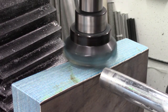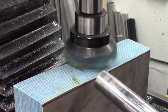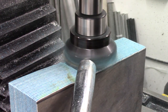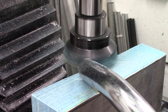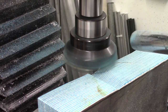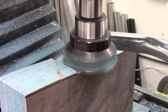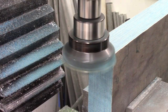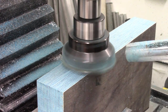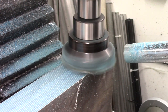Once all the metal work was done it was time to work on the laminate. The laminate we're going to be using is a sort of light blue and silver — I've already done a Red Wolf stock in this and it really does look quite nice, so we're going to be using the same on the Katran. The part we're using is an off-cut from that stock, so the first thing we've got to do is mill the bottom flat. We're using the big face mill — it really makes a nice job of wood, cuts it nice and cleanly. Once we've got a flat on the bottom we can flip the block over in the vise, setting it on the flat and then milling the top. This ensures the two flats are nice and parallel to each other, and then we use a 12mm end mill along the front edge to create a nice 90-degree perpendicular face — giving us a nice zero to work from.